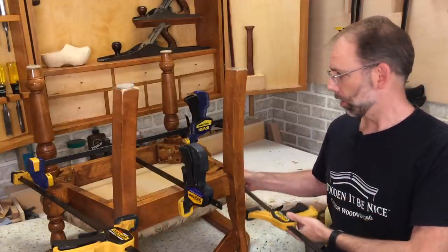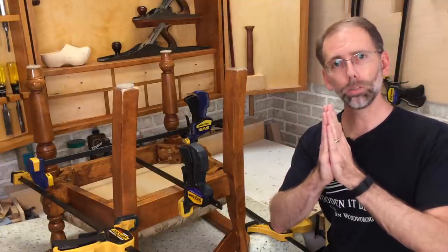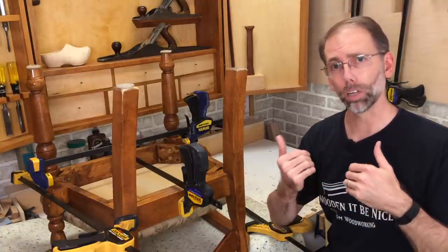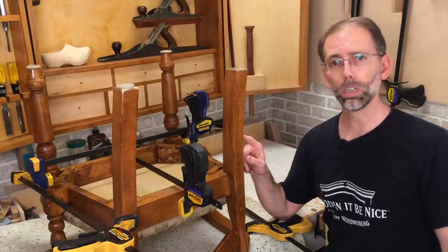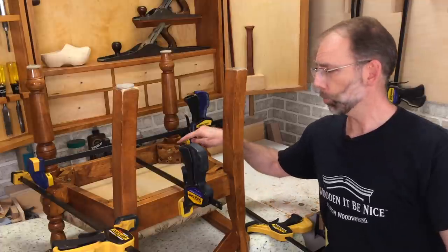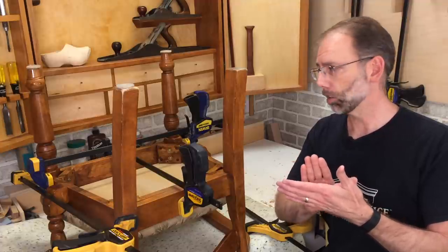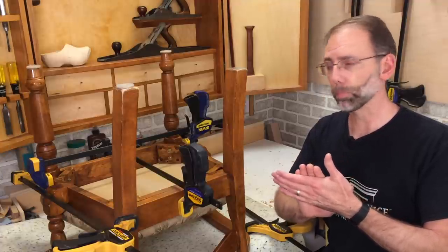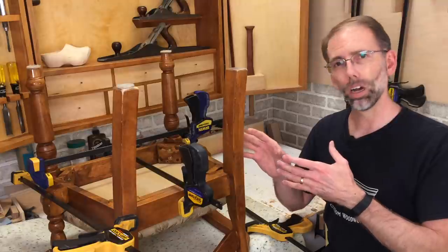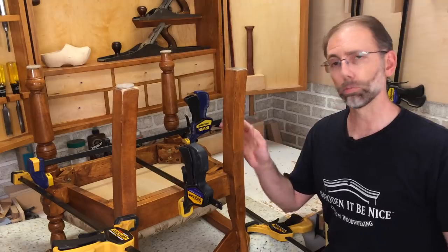The glue on the chair has now dried, so I can take the clamps off. The glue joint with two bare pieces of wood properly glued is stronger than the wood fibers themselves, so I'm not concerned about the repair falling apart. But this wood has already shown me it's fragile, and I don't want this chair breaking again. I'm going to reinforce the inside using the surface area to prevent it from breaking. I'll take the chair apart, mill a few parts, and when I bring it back together I'll show you how to use the physics of that surface area to prevent it from splitting again.